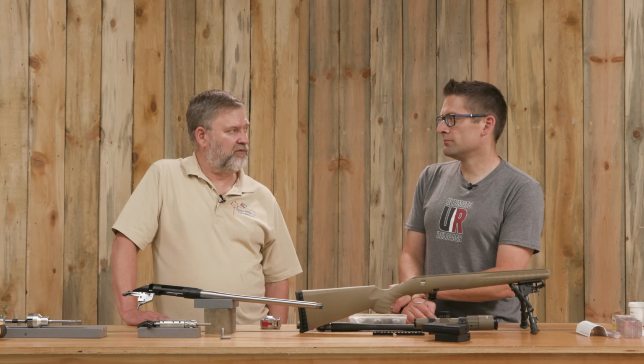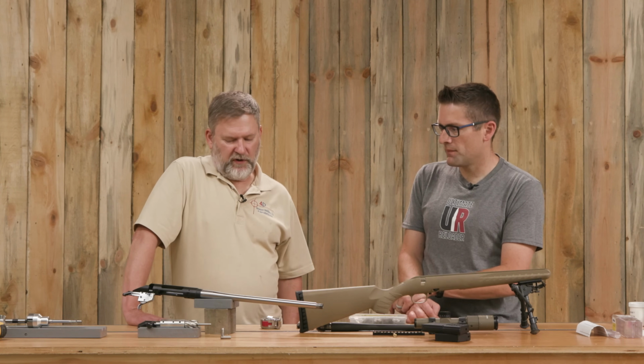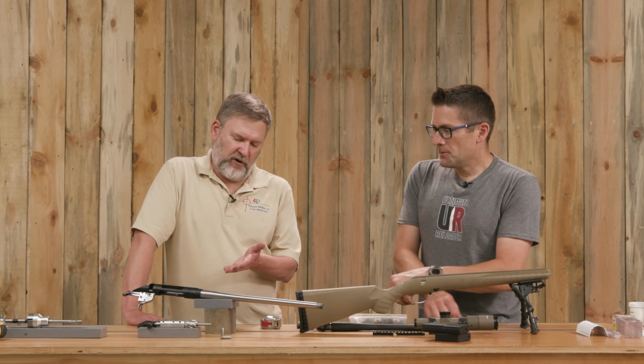Yeah, I like it. And 6-jaws are awesome because once they're dialed in, you can pretty well count on them being the same. Or thin-walled material, holding onto screw threads. A lot of good uses for that. So we grabbed it there. Now we know that we're concentric on the bore and everything is aligned.